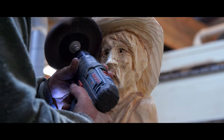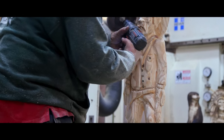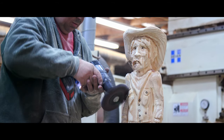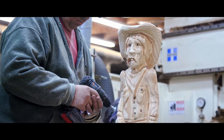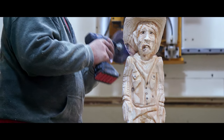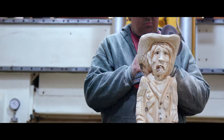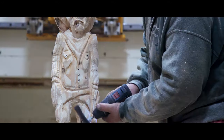We'll be back to the nylon bristle brush here to give it a good wipe down before we get the fire on him. It's a real gentle brush and it's actually safer on fragile stuff than the Sandiflex. That Sandiflex paper would jump out there and grab fragile stuff and break it off. You can still get in there with this and it's a lot more forgiving than the Sandiflex.